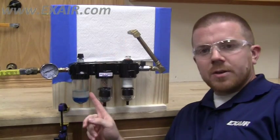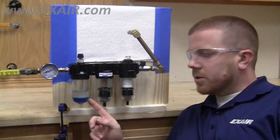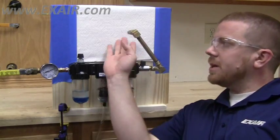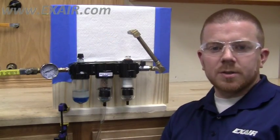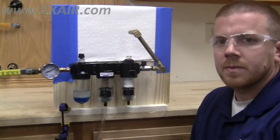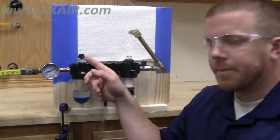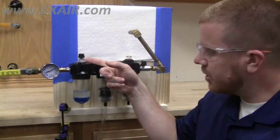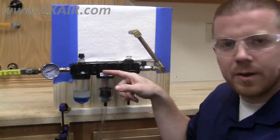The lubricator has been filled with a mixture of water and light oil. The water has been dyed blue so it will show up easily if it makes it through the filtration and gets sprayed onto the white paper towels here. I'm going to go ahead and turn on the compressed air now, and what you will see happening is the lubricator is going to be feeding a steady stream of oil and water mixture into the air line.